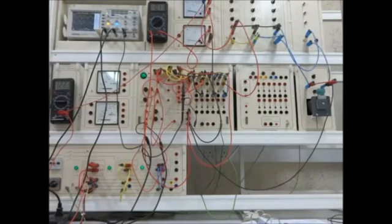Now, observing the waveforms, this is quite important. We are firing the thyristors on at this point here, which would equate to 0 degrees. If you have a look at your theory for three-phase half-wave rectification, you'll know that if we use a reference waveform that's our typical sine wave, where the instantaneous voltage equals the peak voltage times the sine of the angle, this point is actually at 30 degrees. So it equates to a firing angle of 0, but it's 30 degrees from the reference point of our reference sine wave input. You'll probably need to have a look at the templates I've given you for working out what I mean by all that, and you can also read the notes in the experiment lab manual.